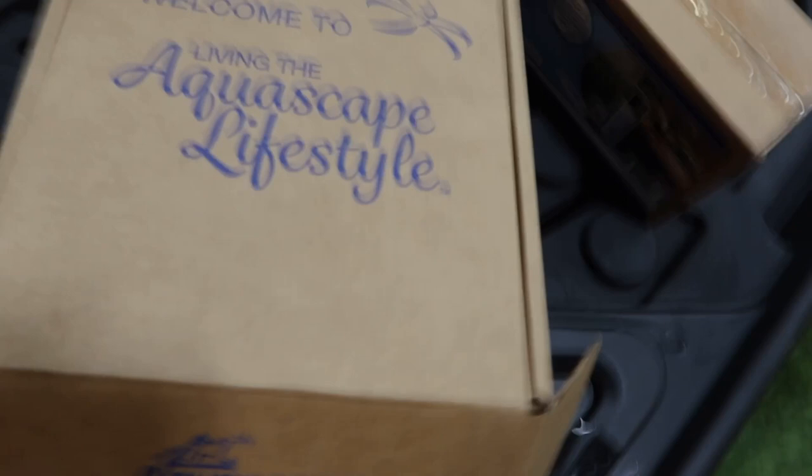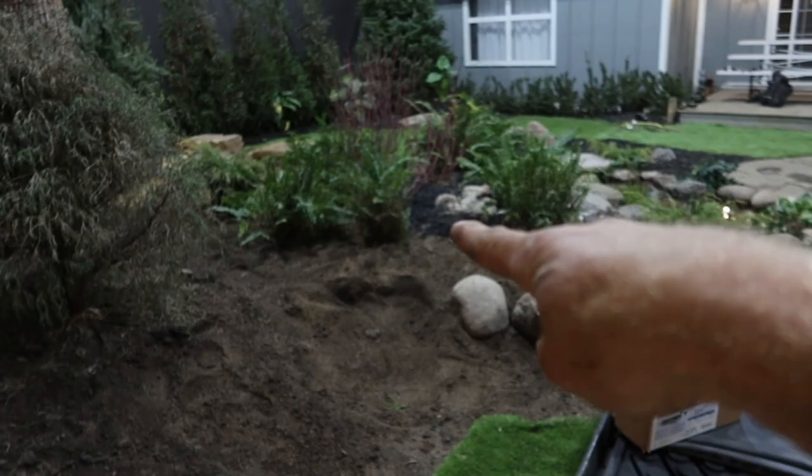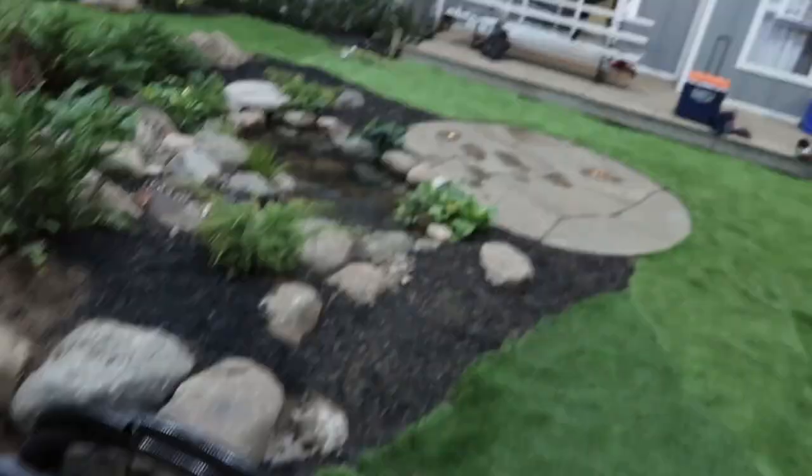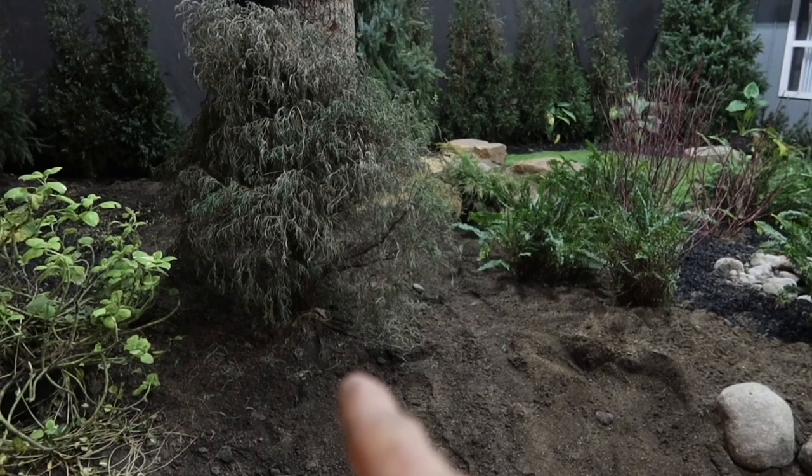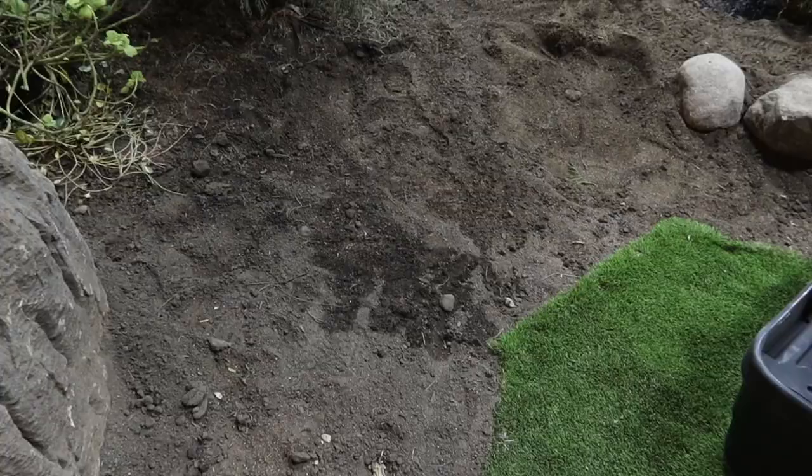Now that we've gone through the components, let me go over the general layout. We're still in the sandbox and we're going to install this waterfall on the backside of the berm we just created with our 7 by 9 ecosystem pond with about a four foot stream - still up and running and looking fantastic. Here's our canvas: the backside of the berm where the waterfall will start. The basin will go down in here and we'll have about a four and a half to five foot waterfall coming into it. I'm going to remove this thread cypress - it's looking a little crispy - then lay the basin down, mark it out, and go through the installation of the AquaBasin 45.